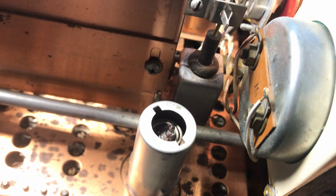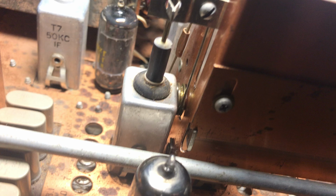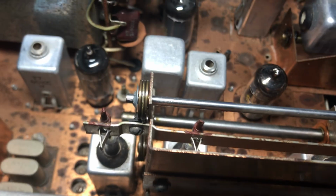Check the pulleys in the bottom down in there too. You see there's a pulley that's way down in here that can bind, so make sure that's got some WD-40. And you want to run these pulleys through a few times before you do anything, because they can have rust and binding spots too. And then once that's all done, you're probably good to go.